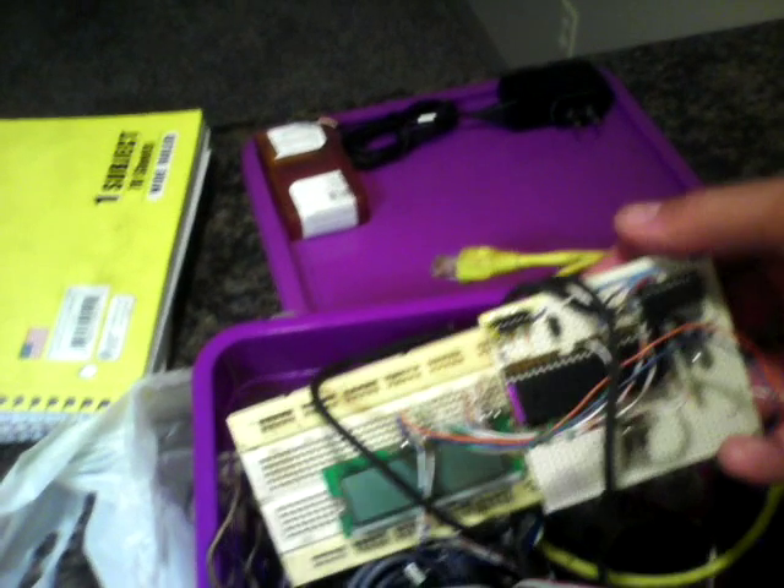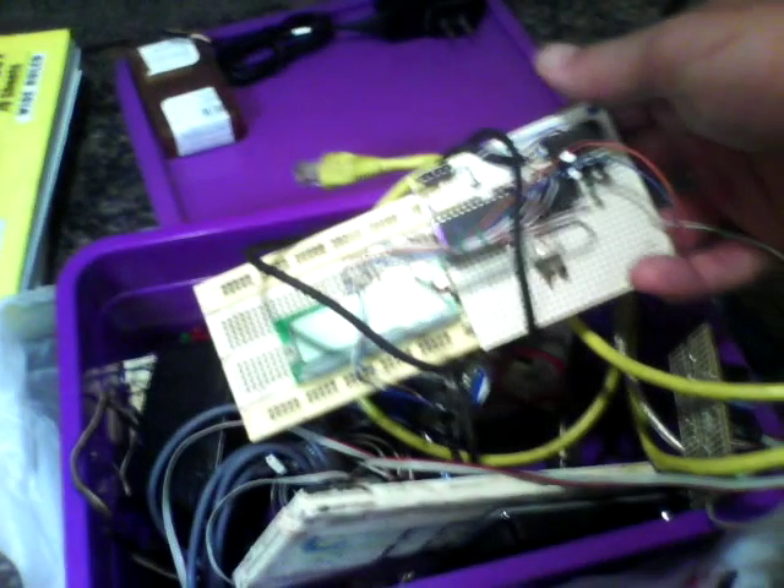It's really small and you can plug it into a board. I got here the controllers I brought from Mexico, and just the Arduino Nano is as big as this microchip PIC. This is a 16F877 with an RS-232 Max converter chip. They're pretty affordable — including the cable and shipping cost, it was around $4. But you can get an even better bargain buying a whole bunch really cheap from eBay.